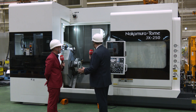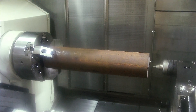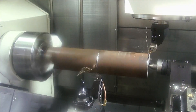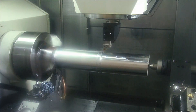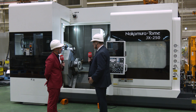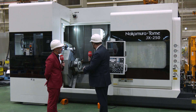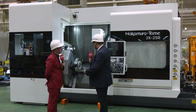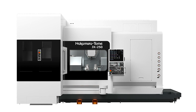They call this spindle the smart cube — it's a new unique design by Nakamura, and it's a shorter spindle in its class. The idea is to be able to put three tools in a cut on a machine like this. If you have too large an upper spindle, you run out of real estate, and by the time you get the spindle horizontal doing ID work, you might not have room to work with the lower turrets. With the smaller spindle, you can put three tools in a cut — support the part with a steady rest, support with a center, use one turret, and cut with two. It's very unique — landing gears, yokes for aircraft — a lot of different aerospace components are being made on this machine.